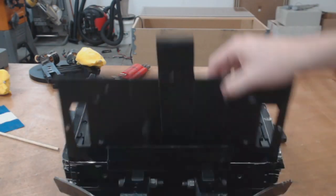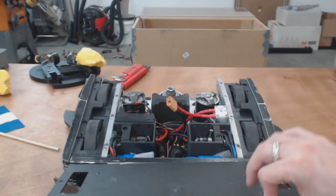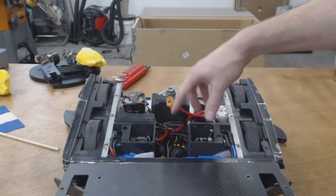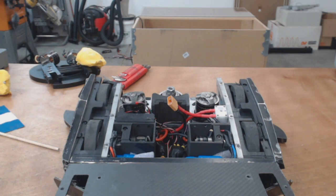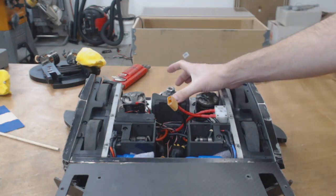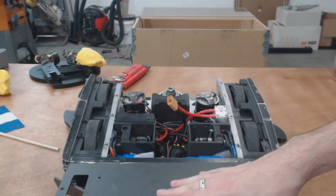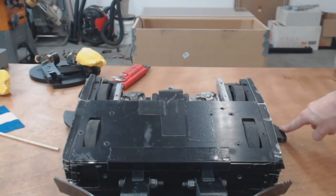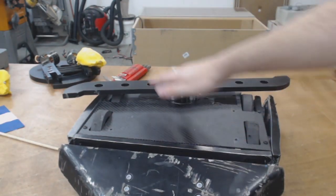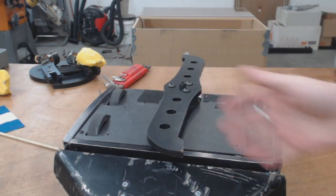I am extremely vulnerable to overhead attacks, since this is just carbon fiber up top and it's pretty thin, and then I just have the carbon fiber on the bottom. So I have my battery very centrally located. A hit from the back, the wedge is in place, and a hit from the front, the battery is still quite a ways away. So it's as far into the inside as it can be, and if there's an overhead attack, that's what this big overhead bar is. If there's going to be any chance of a direct attack on here, I will run this configuration, and theoretically this weapon will prevent any damage from getting into the battery compartment. So that's how I deal with it.